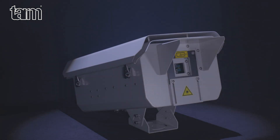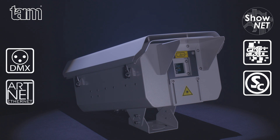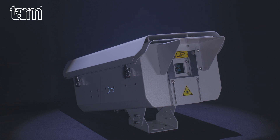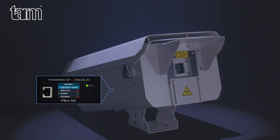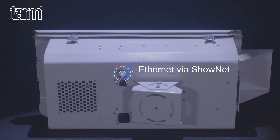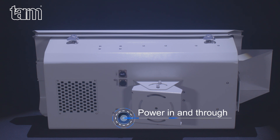The TARM Outdoor Series offers a number of control modes. As standard, they are fitted with an internal ShowNet Laser mainboard for control via Ethernet, using ShowEditor or ShowController computer software, DMX, ArtNet, or any ILDA laser software. An optional Pangolin FB4 interface can be installed in place of the ShowNet Laser mainboard. A LAN connection, interlock connection, and power in and through are part of the comprehensive range of connectivity and safety features in each TARM Outdoor unit.